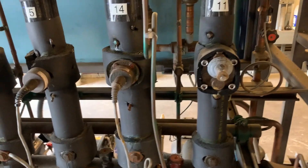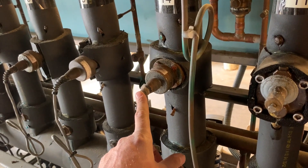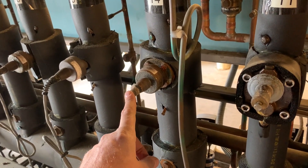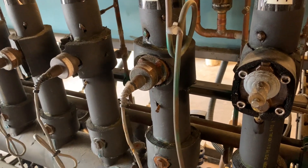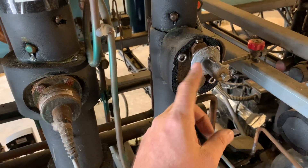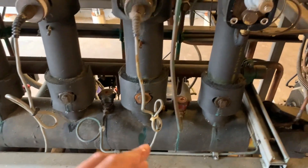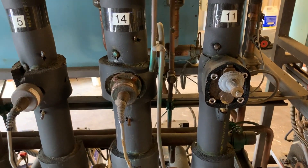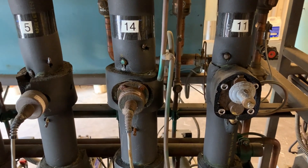The one on the left is an electronic version and it's going to reference a temperature sensor and a pressure transducer to maintain a constant temperature, so it will modulate slightly, whereas the mechanical one will more or less hold steady at the pressure you set it at. But the main idea here is we keep the evaporator saturation more or less fixed to achieve constant run time.